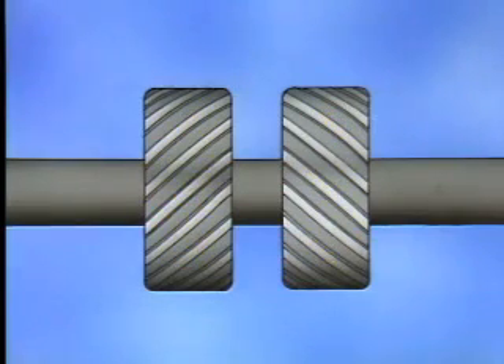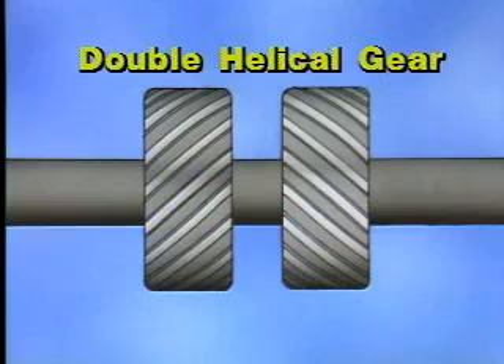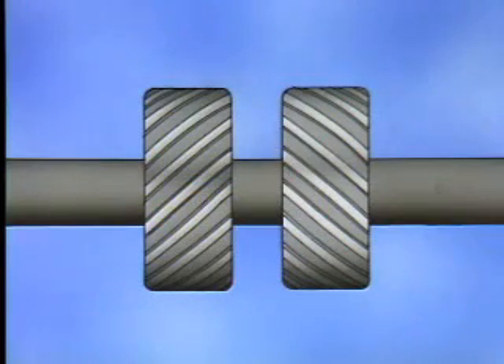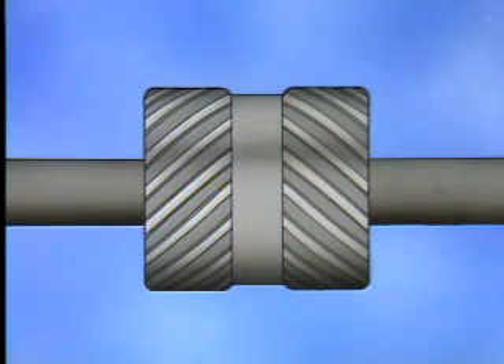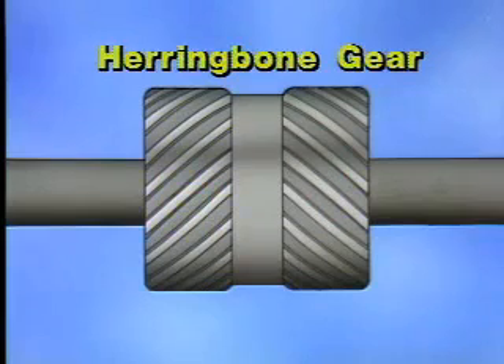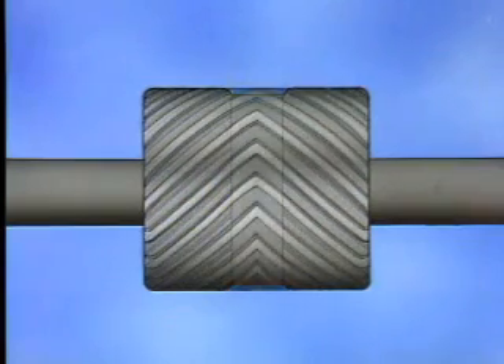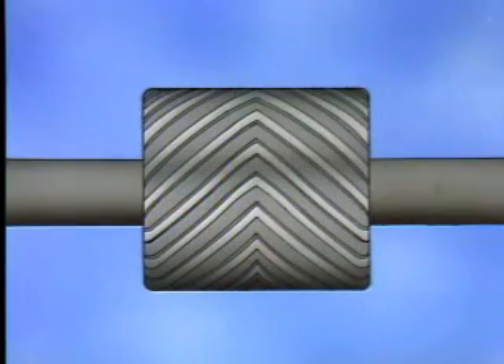This arrangement is called a double helical gear. If this type of gear's right and left sides are cut on the same cylinder, as shown here, the entire unit is referred to as a herringbone gear. There are herringbone gears in which a gap has been manufactured between the two sets of teeth, and there are others which are manufactured without this gap.